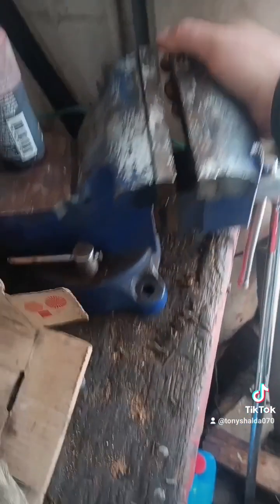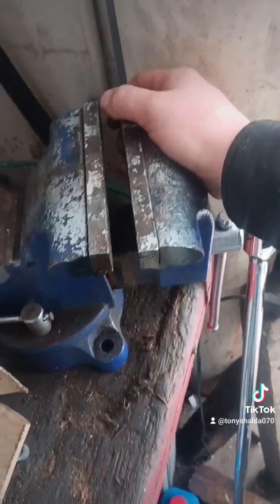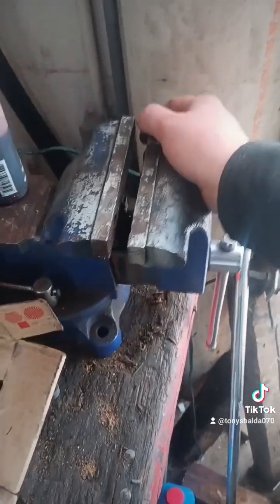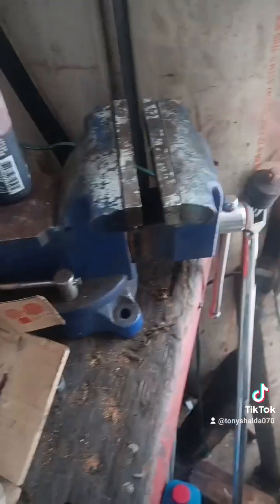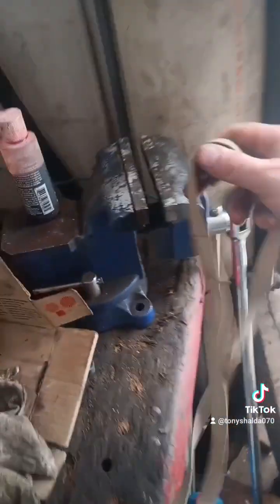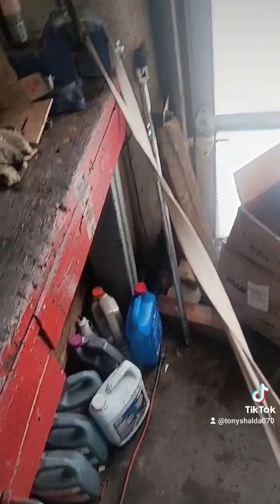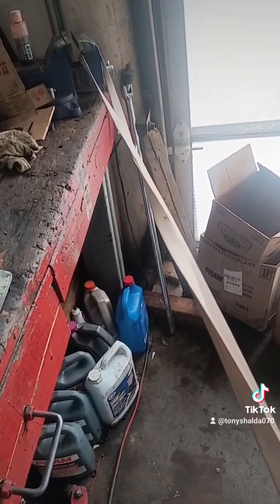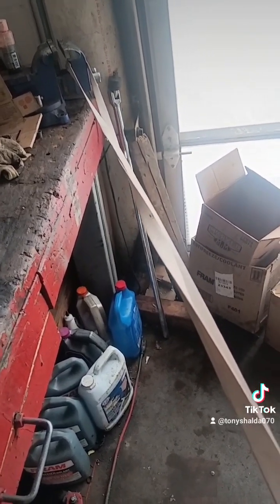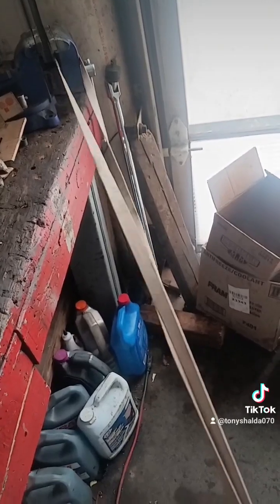We can use pulling on this loose vise as an example. If we treat the vise like the head of the bolt and my feet like the threads, I can take one step back — likening that to turning a regular bolt 20 degrees — and the whole vise moves. I have no idea how much force it took; maybe 10 pounds. Now if I put something stretchy between me and the vise and take one step back 20 degrees, it doesn't move — five pounds of pressure. Another step back, still five pounds. It doesn't matter if I overshoot it a little bit. The bolts are more like taffy than a rubber band, but this might help some people understand.